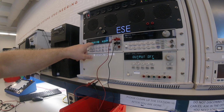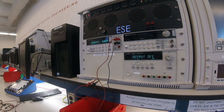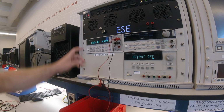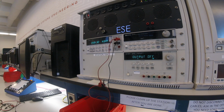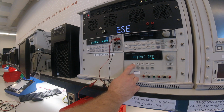And you see that I have 0.5 kiloohms, or 500 ohms. Now, they were 510 ohms nominally, but 503.7 ohms is within the tolerance of the resistor. So now I'll move my connections, and I'll measure the other resistor. And I have again 501 ohms, 0.501 kiloohms. And to verify that they are indeed in series, I can measure across both of the resistors, and I have 1 kiloohm.